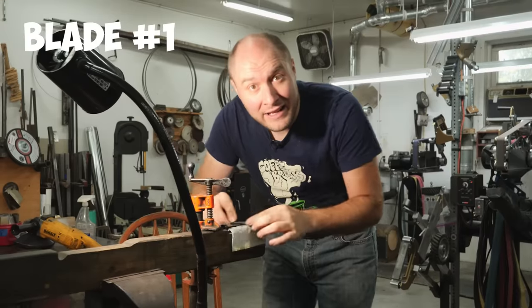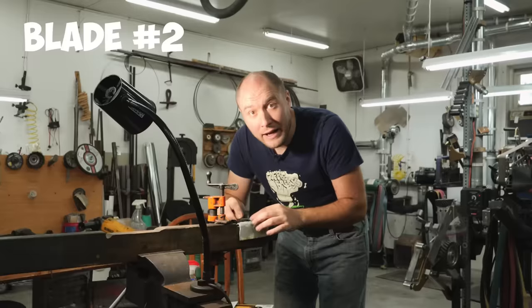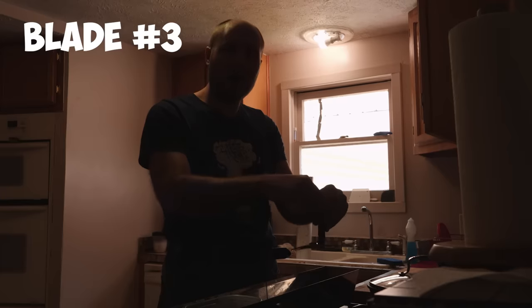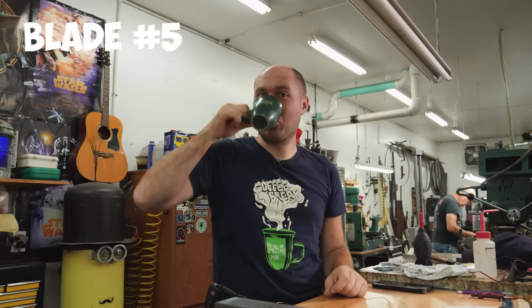The process repeats: etching, neutralizing, hand sanding, etching, neutralizing, hand sanding, coffee darkening, polishing, coffee break — again and again. I've got my extra long drywall pan here for the coffee darkening with some hot water and a whole bunch of Nescafe bold coffee to soak the blades in and give a nice dark contrast on the 1084.